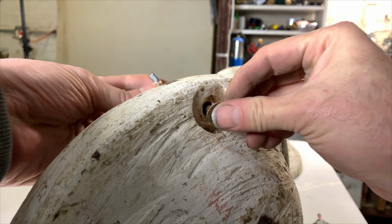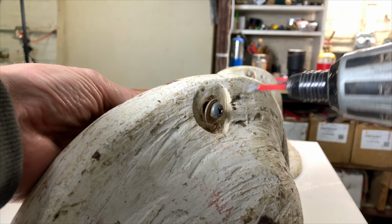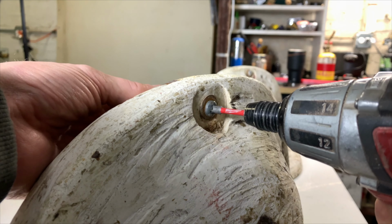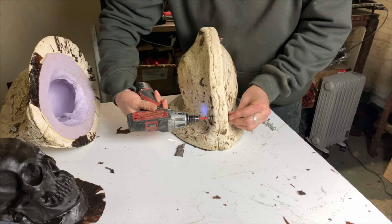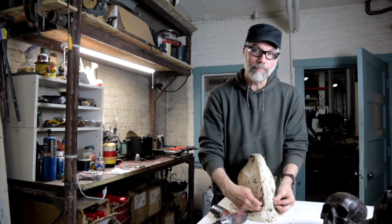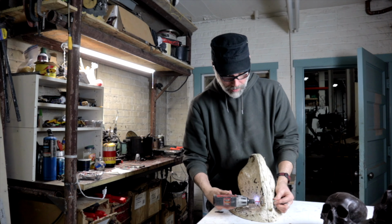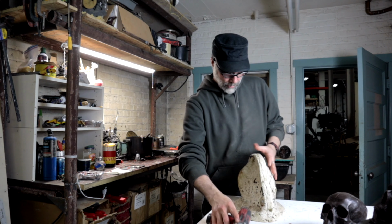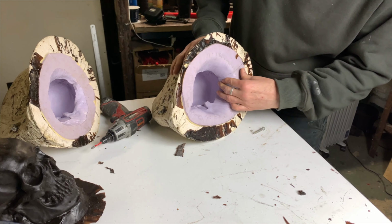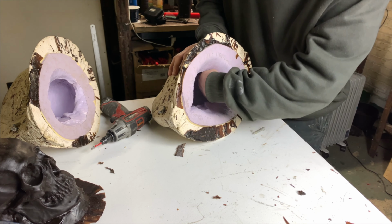and that's ultimately when I started using screws. They're just machine screws with a Phillips head, which is why I'm using the drill. And then instead of an actual nut, I'm using a wing nut, so I can use my hand to grab onto them. So I'm not using two tools, a wrench and a screwdriver. It just makes it a little bit quicker. So anyway, now the mold is prepped, saturated so the wax won't stick to the outside edge, and we're ready to start spinning the wax.